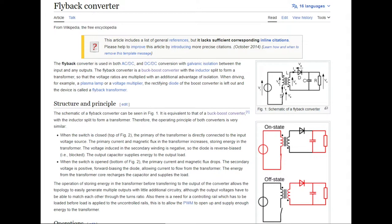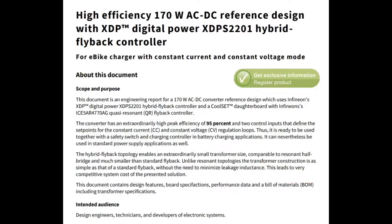There are some trade-offs with flyback converters — they tend to be really big and they're not great at lower voltages. Here we're bucking down from 100 or 220 volts to 48 or 32 volts, and that's where this hybrid flyback controller design comes in. What's neat about it is it's very small, inexpensive, and very high efficiency — 95%. You get the efficiency you'd expect from a standard DC-DC buck converter, but this design is flexible about the input.